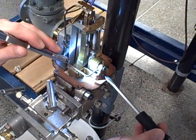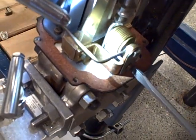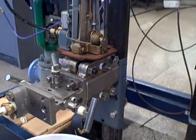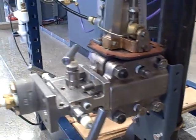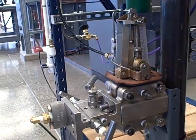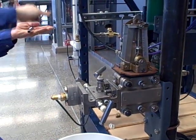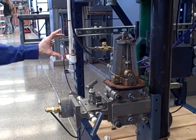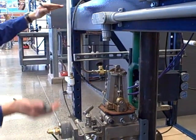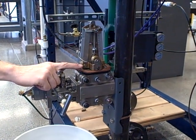So don't do that. Whenever you're adjusting this zero spring, you want to be careful to look at that spring and watch what you're doing so you don't go too far and over-compress. You always want to make sure there's some air gap between the coils of that spring, so that you're sure you're not all the way compressed. Now, this can be a problem in this setup because sometimes we'll run out of range. We may have a situation where we just can't get enough suppression out of the zero screw with what we're trying to do with our process. As a general rule, when you're using these Foxborough 13As, you should keep the amount of suppression a very small percentage of your overall span. To show you what should not be done: if you set your lower range value at a very high point, that's a large amount of suppression compared to the span you possibly have, and I guarantee you will run out of adjustment when you try to take that suppression out with the zero screw.